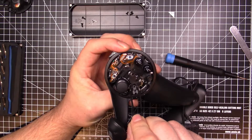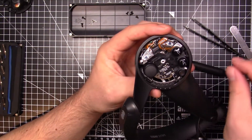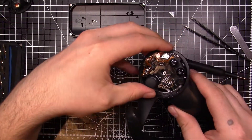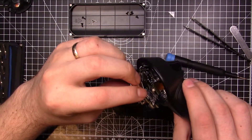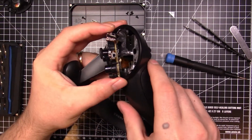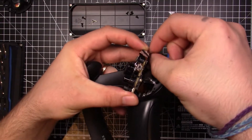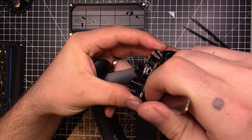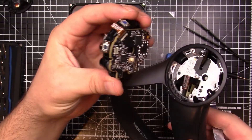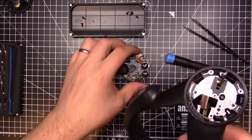Now, we can get a pair of tweezers and gently lift out the ratchet-in system for the strap. Pop it to one side — even if it falls apart, that's fine, just remember the orientation it was in. At this point, we can pop out the top motherboard — the whole motherboard collection, shall we say. Again, there are ribbon cables — two of them: one Lego-style one and one ribbon cable underneath. So don't just yank on this thing. Take your time, be slow. Pop out the top ribbon cable; the next one's the Lego-style one, which I released with a spudger. Once it's released, the entire index body can be set aside for the meanwhile, and what we're left with is the brain of the controller.